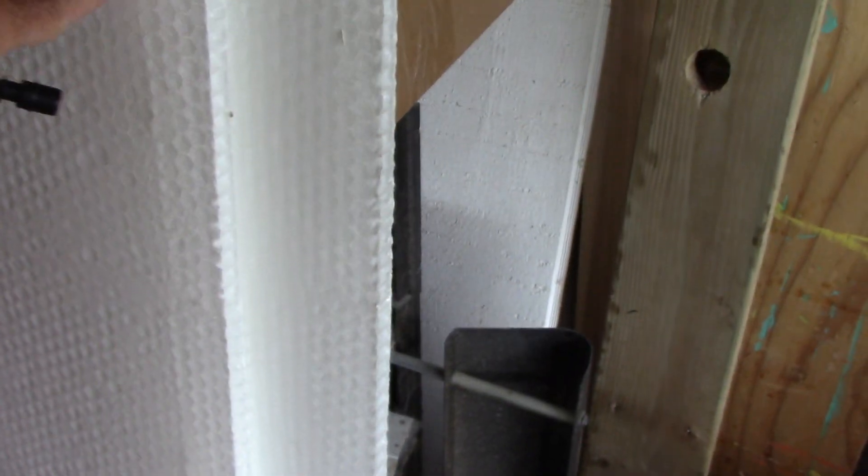Now I'm at the step where we gotta build the floors, or the sole — the part you're gonna stand on. This stuff is called Divinycell — basically a honeycomb material that's really rigid. I've already glassed a bunch of it that I'm gonna use for the deck and everything. It's got two layers of 12-ounce fiberglass on one side and just one layer on the other. This one turned out kind of funky with bumps so I'm gonna use it in places that aren't gonna be seen — under the deck in the front and back.